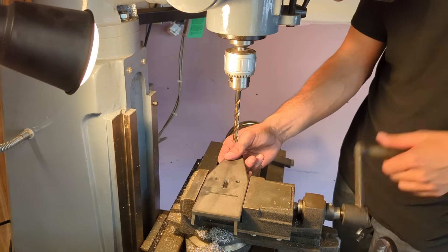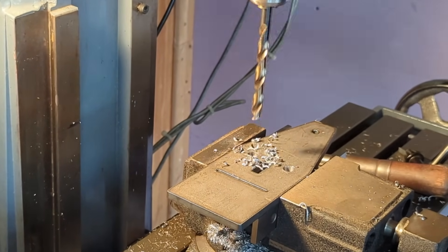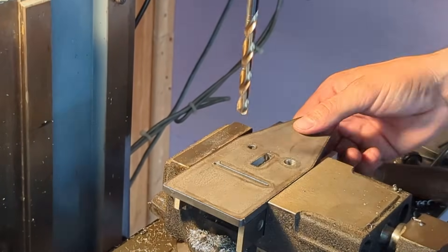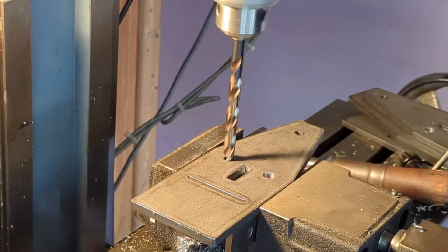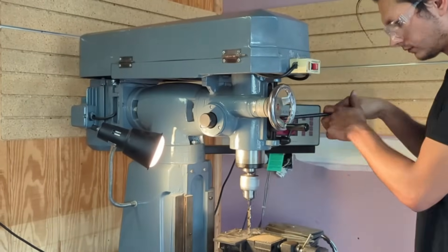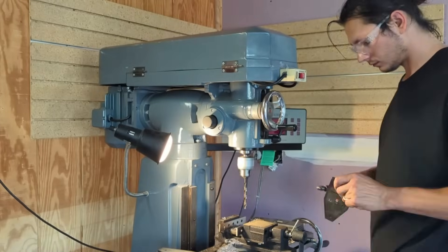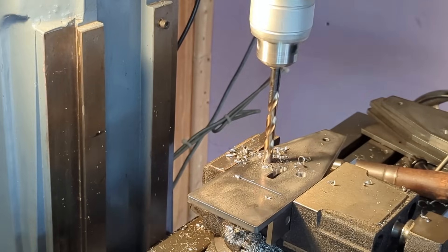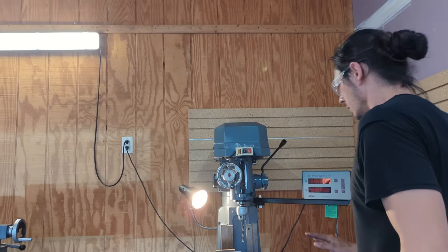But that wasn't just milling slots — there was also some drilling. There were three mounting holes on the top that were supposed to be 3/8ths, but because of the kerf angle problem I had to drill all of them out again. I basically used the drill bit as a reamer just to clean up the insides of the holes, but it was really hard on the drill bits because the inside of the holes were surface hardened by the stream of plasma and the rapid cooling of the water. The drill bit wasn't toast but it definitely needed a good sharpening after this job.